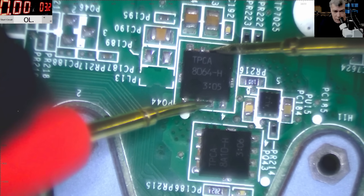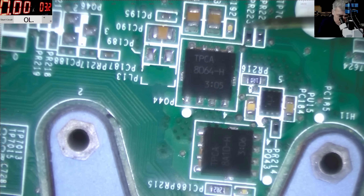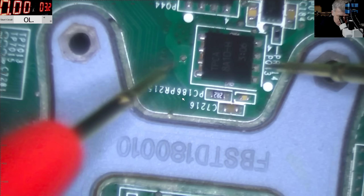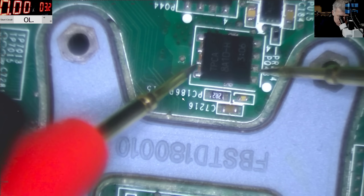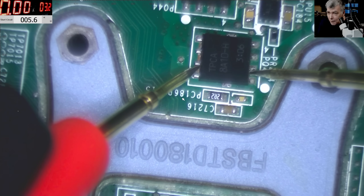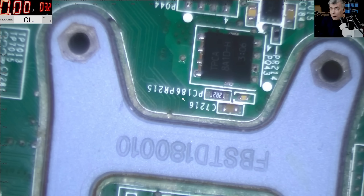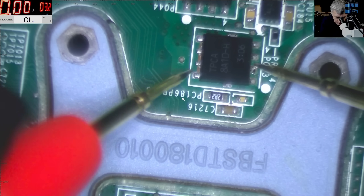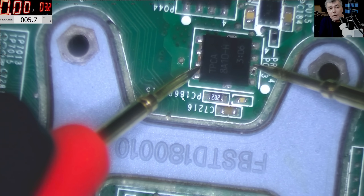You will think this MOSFET is good. Now let's test the second MOSFET - same three pins together here and four pins together here. You are testing here and here and it's beeping - you can hear it. You have 5.6 ohms. You found the fault, you found the shorted MOSFET, right? One more time you can hear the beep and you can see on the ohmmeter you have 5.7 ohms.